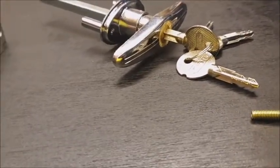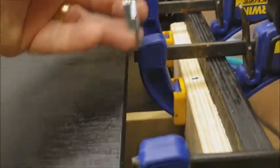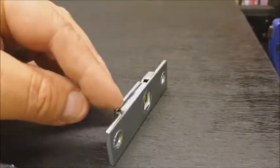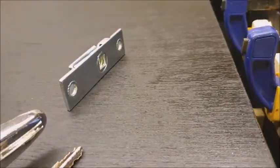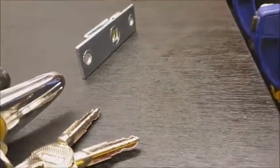So once it's all done, I'm just going to whip the top off, because once this goes on the back of there behind the T-handle, when that flips up, I'm going to have to route out a piece on the underside for this little cam to fit into. And what I'll do is I'll get a bit of aluminium flat plate and screw it to the back to strengthen all the wood up in that area. And then the top can be glued and screwed down then.